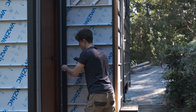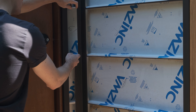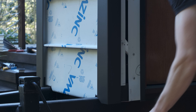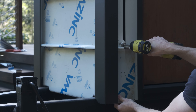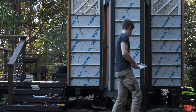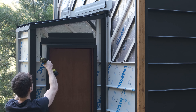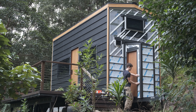On the sides of the doors I can only fit very small sections of panels, and truthfully they don't really do much next to the door on the smaller side because the backings for the flashings overlap there anyway — but it would look strange without them. As I'm tucking the panels behind the flashings it's a bit difficult with these small ones compared to larger panels, as there simply isn't enough room to get them in without cutting them down a little extra. I really tried to optimise these so they were as large as possible while still fitting between the flashings.